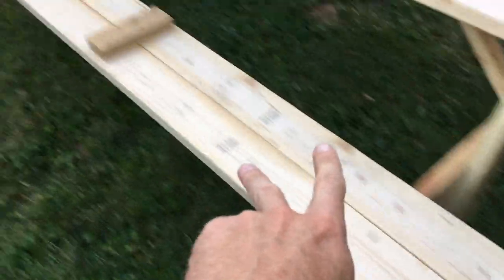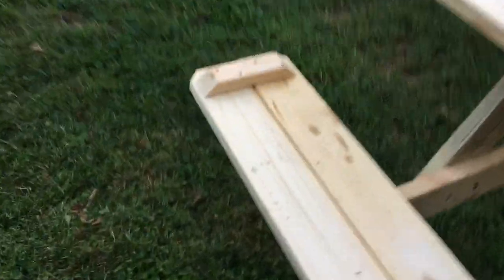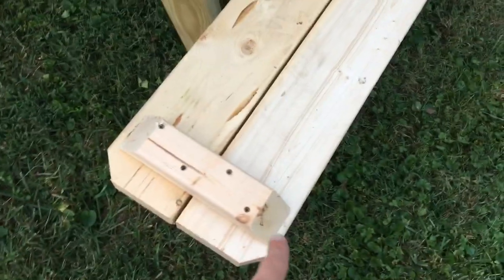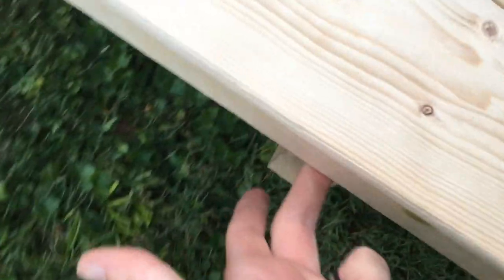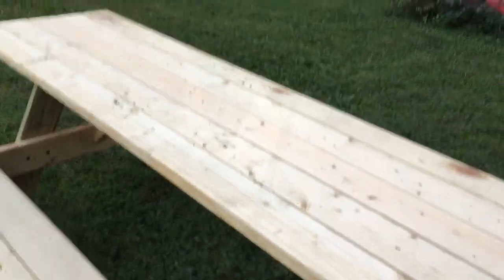To make the benches, you simply take two of these 10-footers and put one support piece up here in the middle. On the ends, I like to get a little fancy — you don't want to stub your knee running into the corner, so I just shave off the corners and miter cut them freehand with my saw at a 45. So: one piece on the end, one in the middle, one on the end. Then we flip the bench board over, set it so it's hanging a knuckle over the edge, and just drop four screws in along there on each side. Boom — it's attached, it's done.